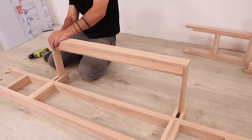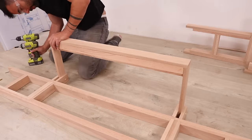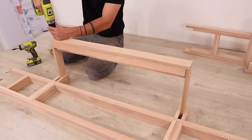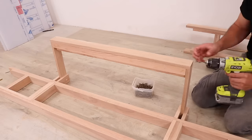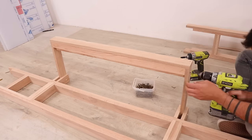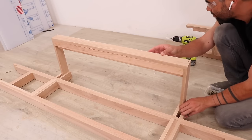I used finished screws to attach the handle to the hinges — three two-and-a-half inch long screws on each side. I could have added glue to these connections to make them a little bit stronger but I didn't want to have to sand into all the nooks and crevices to remove any extra squeeze out. Plus these connections will be reinforced when I screw the door on.